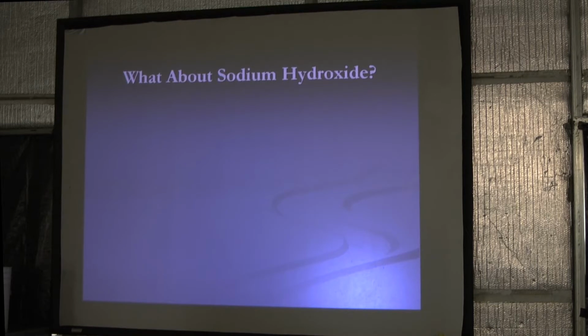Now, in a lot of YouTube mirror instructing, they'll tell you to use sodium hydroxide instead of potassium hydroxide because it's easy to get. It's a common lie. When you're looking at these YouTube presentations, you're not able to go up there and look at this mirror that the person made and really critically judge it. And they're not trying to first silver a telescope mirror. They're just doing a gee whiz, wow, we look at this, I put silver on glass. But you can't really judge it from a computer screen of how well it turned out.